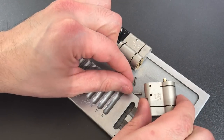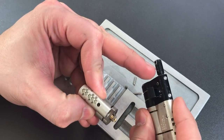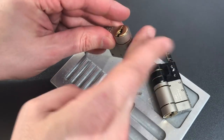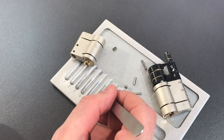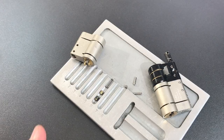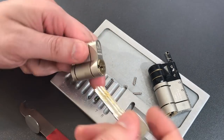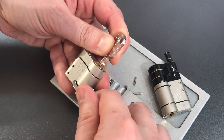When we remove this, you can see that one of these pinholes — number six — was actually capped off by the steel rod that goes into that hole, so we essentially just opened that up from the top. Let's see if we can get the number six pins out of the lock. It looks like we have some sort of anti-bump pin in number six and a nice stout steel spring. The next thing we have to do is remove the c-clip that is hidden right here.